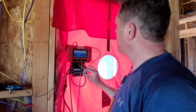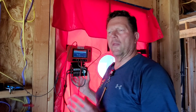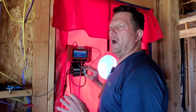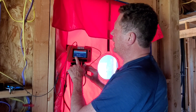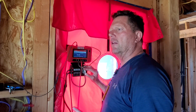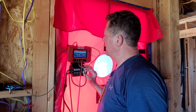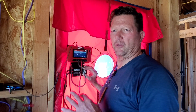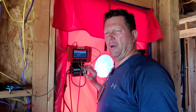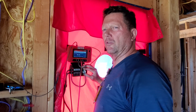I've got the Energy Conservatory manometer — this is the DG1000, so a lot of it is pretty much remote or automated. Right now I'm just going to use it manually. I've got my pressure set with airflow at 50 pascals, and I have it set at ring D right now. I can't get my pascals above about 20, and I'm supposed to be getting it to 50. We'll leave it there for now and figure out what's going on later. My main goal is just to get it moving — we're pressurizing this building so we can watch smoke leaks from inside. Let me get this up and running and we'll do some smoke testing.